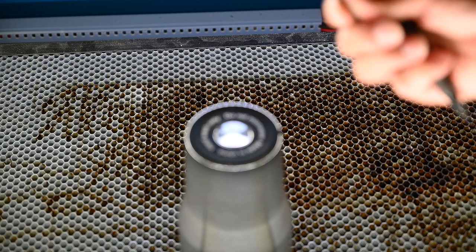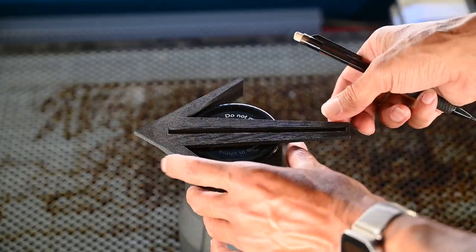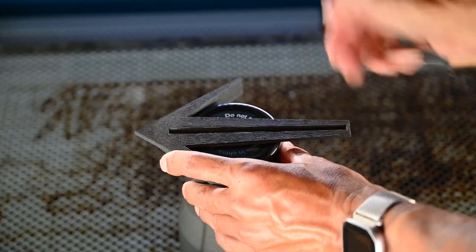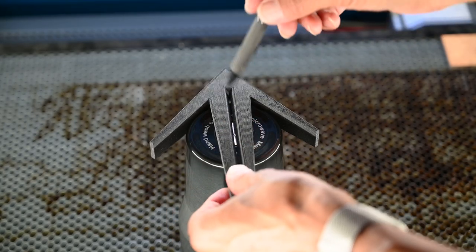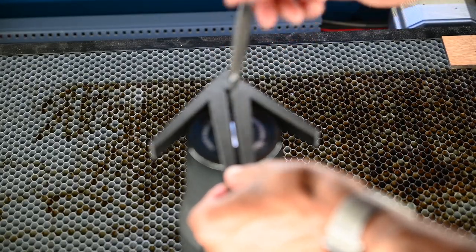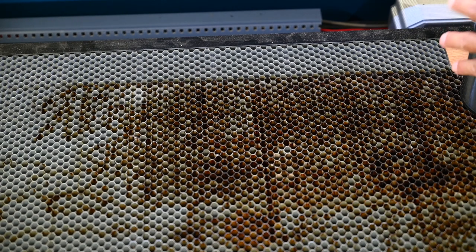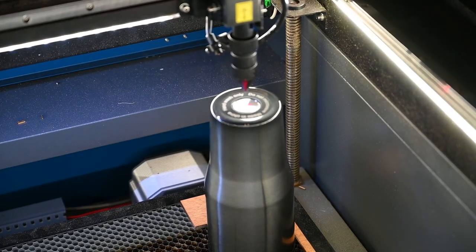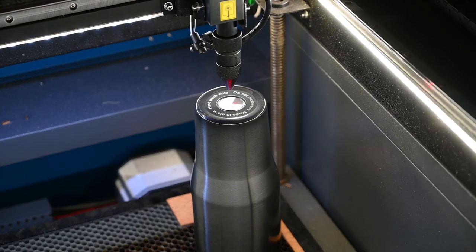This is a circle center finder. I sell this and there's another piece that goes along with it, useful for logo placements. All you do is place it so that these two edges are tangent to the circle, draw a line, then turn it — doesn't have to be 90 degrees — draw another line, and that's always going to give you the perfect center of your circle. Now I have a good starting point for my laser. I'm going to go ahead and burn a 20 millimeter circle just to confirm it's working okay.